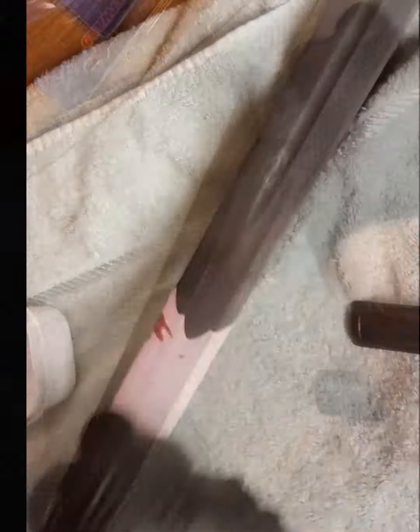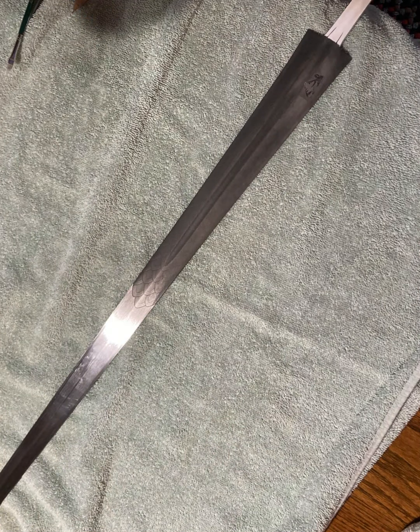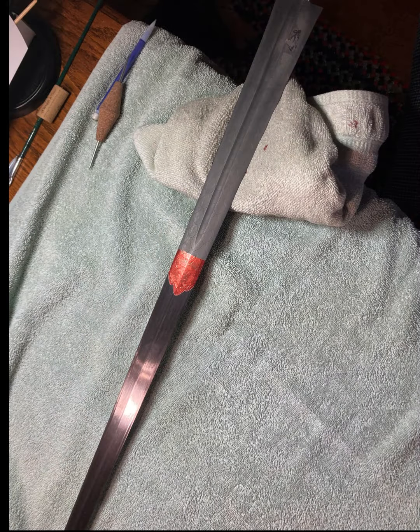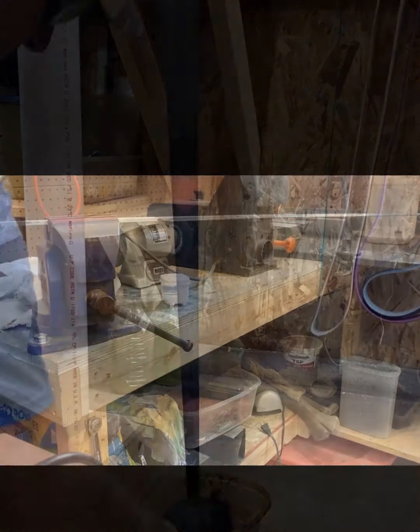With all of the image etching finished we can now remove all remaining resist using acetone. Now I must quickly etch the bottom portion of the blade to achieve a consistent look from the top of the blade to the tip. Note the use of nail polish where the scales meet the bottom of the blade. At this step I could not allow any further etching on the scales.